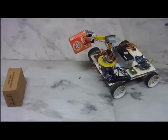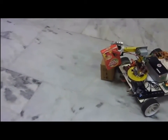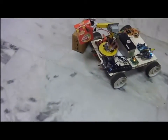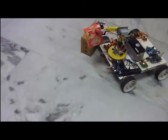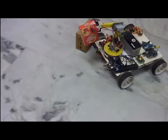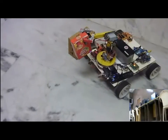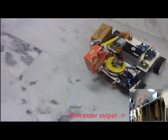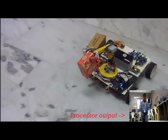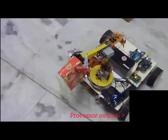The processor identifies the human face using a Haar cascade classifier. The robot then searches for a human face within its field of view and the control command is sent to the controller to rotate the robot to get a 360-degree field of view. If a human face is detected, the sonar is enabled to estimate the human's distance from the robot, and the corresponding action is taken to reach the human and drop the picked-up item.